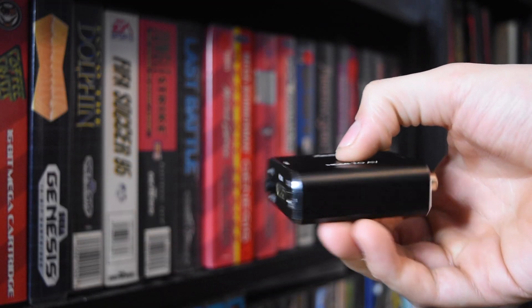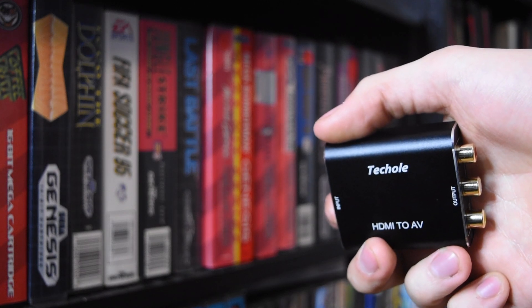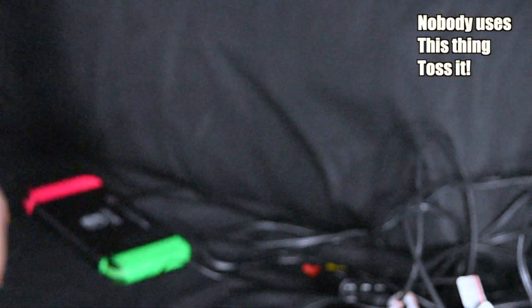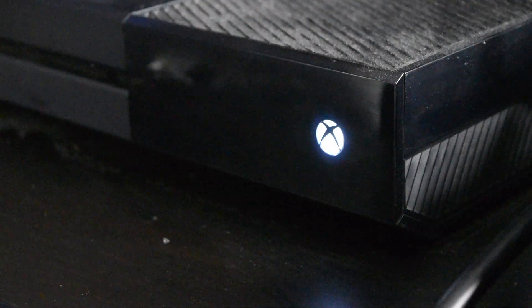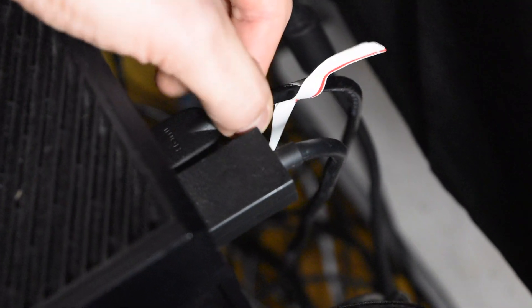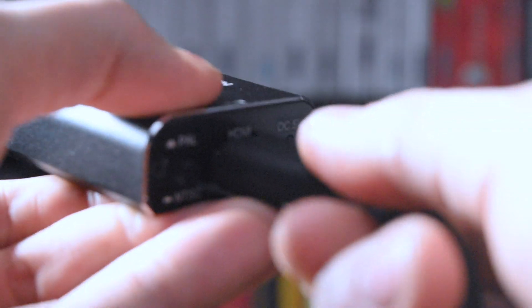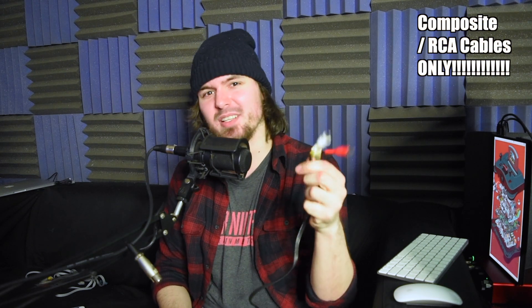I'm sure you followed all of that. So you've got this converter — what do you do? Well it's really easy, let me walk you through it. I'm going to be using an Xbox One, because that's the most popular console, right? So let's make this borderline easy for everyone. Boot up your Xbox, plug in an HDMI cable into the HDMI out of your console like you would normally do, but don't hook that up to an HDMI television. Take the other end of that HDMI cable and plug it into the converter. Grab these composite cables — you want the lowest quality signal you can. You can even do RF. I'm not going to, because screw RF. But grab these cables and plug them into your CRT.